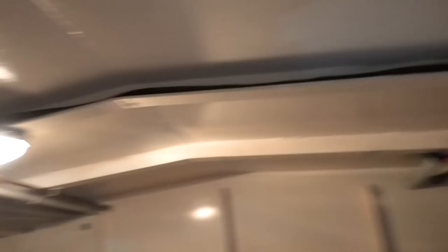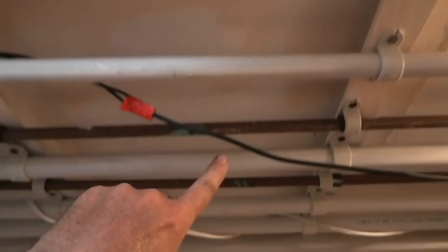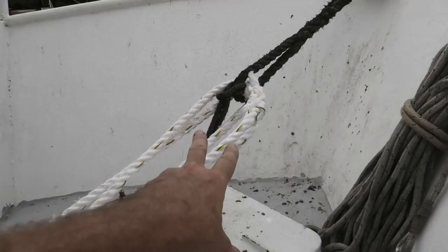Directly at your feet from the wheelhouse is a bit of accommodation down below. The berth has got a little bit of storage at either end of the bunk and a couple of lights — oddly only switchable from up in the wheelhouse, so I'll definitely rig a switch down here as well. There's also a bulkhead going to the chain locker, a little pivot telly, the Morse cables for the throttle and gear selector, and the two hydraulic lines for the steering. The rest of the electrics look quite well done, though there are some looped-up ad hoc wires I'll pull out and clean up.